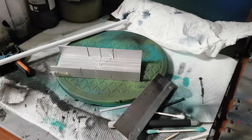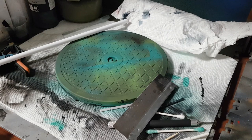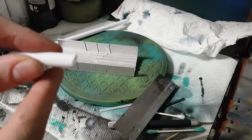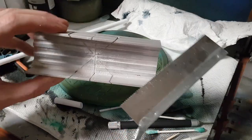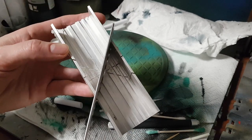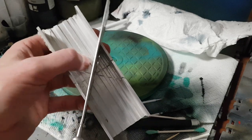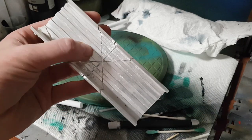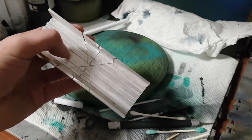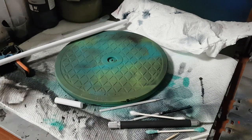You might be wondering why on my first angled cut I didn't start at the very end of the pipe. What happens is you might catch the edge and get a misshapen part, so I just moved in a bit from the edge for a completely flat surface. To cut 45-degree angles, just put it in the angled channel and the guides keep the saw in place. There are different size channels for different sizes of stock. So the new tools are a miter box and a saw.